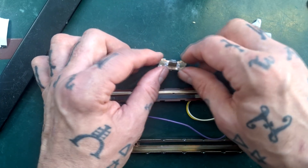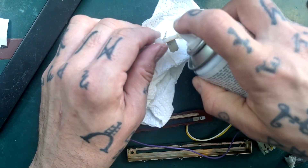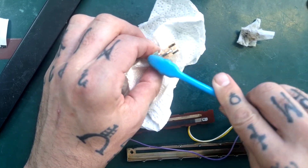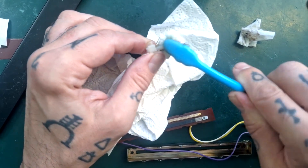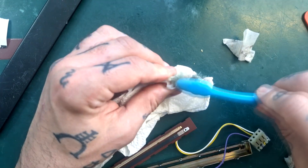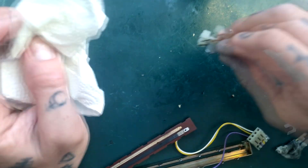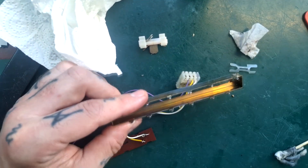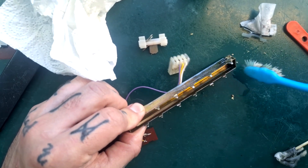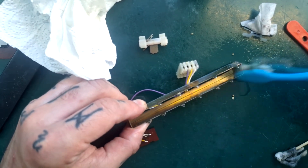For the shoe, it's helpful to get some contact cleaner, put that on there, and get something like an old toothbrush to make sure you've got debris and old grease off of everywhere before reassembling. You could do something similar with the casing — spray some contact cleaner in there and get in with a brush to make sure any muck caught particularly in the four corners is out before you start to reassemble.